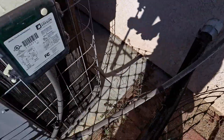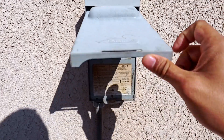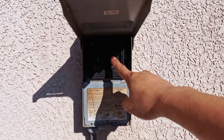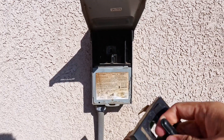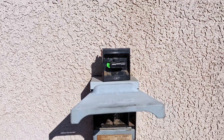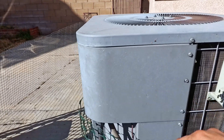Go ahead and pull the fuse — it's located in this box right here, just connected single line. You'll see it somewhere near your AC unit. Lift this up, push that back to lock it in, and there's your fuse. It says 'pull' on fuses, so go ahead and pull that off. I always like to just set it on top just to be on the safe side. Now we're able to start working on the AC unit.